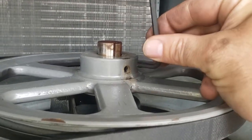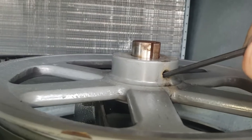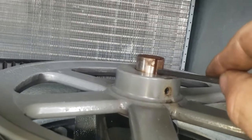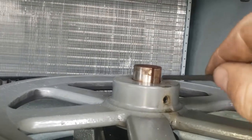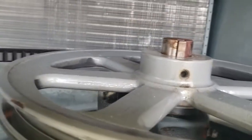After you've done that about ten times, it's wearing a little round groove into that key. The end of the set screw has little rough ridges on it to help it stay in place, so when you're tightening down, you're kind of digging into the key. That should make a nice little indent for the set screw to sit in, and that a lot of times will help prevent that lateral movement — the sliding-off-the-shaft action. I got it all tightened in there, she's good, and that's something you want to check during seasonal maintenance.